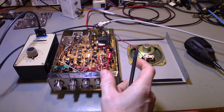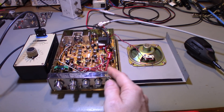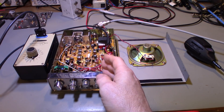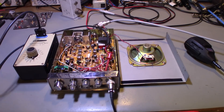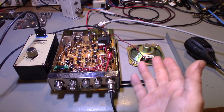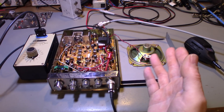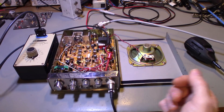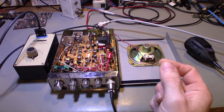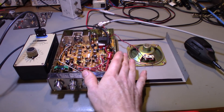What we want to do is add a tone control to this radio. A lot of radios have that built in, but radios like this don't. This is a Uniden PC 68XL I pulled off the shelf. What we want to try to do is get rid of some of that hiss out of the receive audio, and we're going to do that with a capacitor.